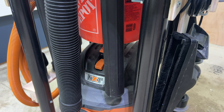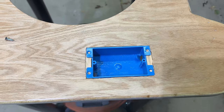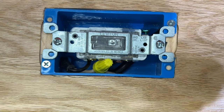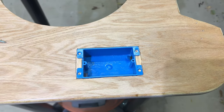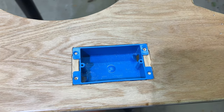Using the wing nuts makes it easy to remove the top in case I need to empty the shop vac, which actually isn't very often. I used this setup for a few months but was really annoyed having to reach the power button down below. So to fix that, I bought a blue shallow PVC electrical box, a switch, and a stainless steel cover to add a switch inline right on the top of the cart. I cut a hole for the switch to sit into and chiseled out an area for the box tab so that it sat flush with the face of the plywood.